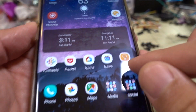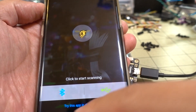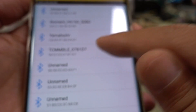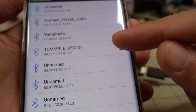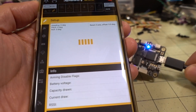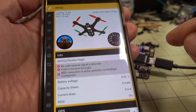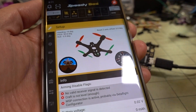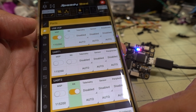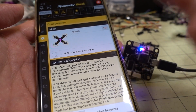I'm going to power up the board via USB, which will turn on the Bluetooth radio — any 5V source will power it up. Launching the SpeedyBee app, you select Bluetooth and make sure Bluetooth is turned on. The Bluetooth radio on this board shows up as 'TCM_MBLE' followed by some random numbers and letters. Connect to that, and it connects to the flight controller. You can rotate the board and see the accelerometer information update live — so we're connected. It works basically the same as I've demonstrated before, with a few app updates, and it works with the newest Betaflight — I think 4.0.3 is currently flashed.